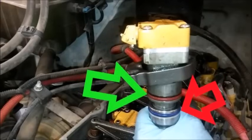What else can cause HEUI problems? The injector seals themselves or the injectors can also cause problems. This is a 3126 injector — the green arrow and the red arrow point to the O-rings that seal the HEUI rail inside the head. The upper O-ring (green arrow) can fail, and when you try to crank the engine, the HEUI oil will pour out around that seal and you will not build any HEUI pressure. You won't notice it, however, because this is under the valve cover. If you pull the valve cover and crank it and you see one injector is spraying oil a lot more than the others, you know that injector or the injector seal has failed and is causing a HEUI issue.